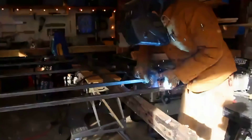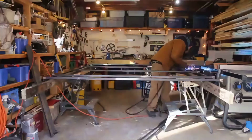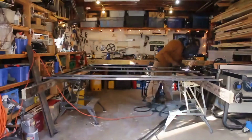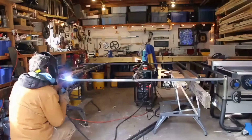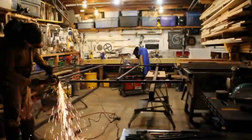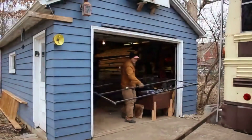What really impressed me were the synergistic MIG settings, which are particularly beneficial for beginners. You can essentially set it up and start welding without spending too much time adjusting the settings. One of the standout features is its performance with aluminum welding. The included spool gun is a fantastic addition, making aluminum welding much simpler than you might anticipate. I've tested it on various materials, including mild steel and stainless steel, and it consistently delivers excellent results.